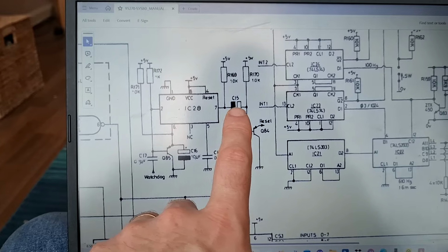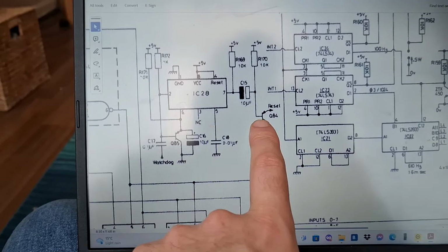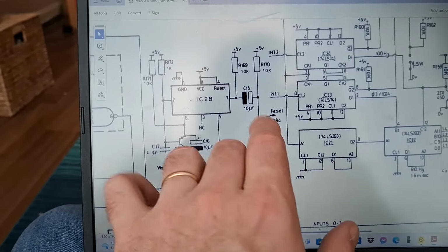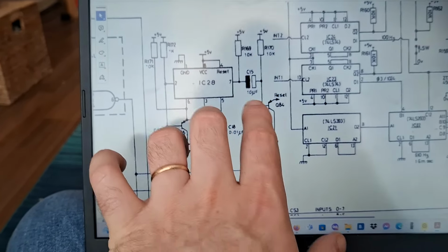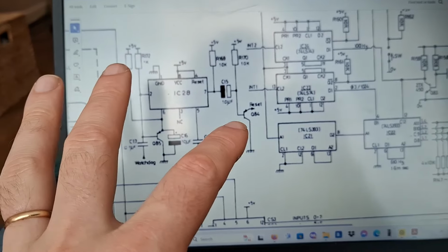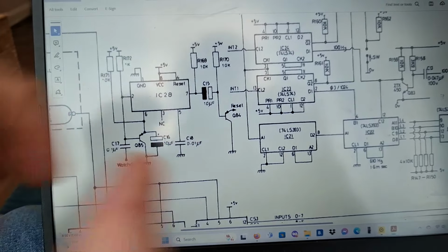See? So then this 5 volt is pulling back through here and turns it off. Remember, it's a PNP. It needs low there to turn it on, close to 0 volts, and a high signal to turn off. It's actually about 0.6 volt, but by the time you go through this resistor, you get 5 volt through this resistor down here and it turns it off. Okay? It's the important thing you need to remember. Always remember that with a PNP, you're sending a high logic signal to turn it off. With an NPN, you send a high logic signal to turn it on. Okay? With me so far?